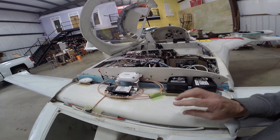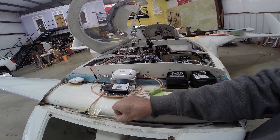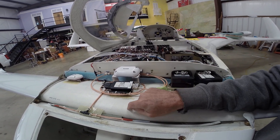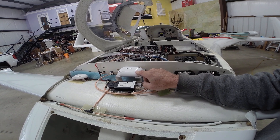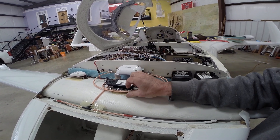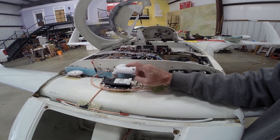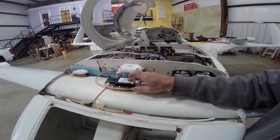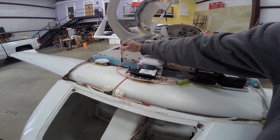My canard didn't have the foil installed for the glide slope and VOR antennas, so I made these — it's called a double bazooka design — antennas for the glide slope and VOR, and they're just laying in here. There's also an ADS-B receiver covering 978 and 1090 MHz, and here's another little double bazooka antenna for that.